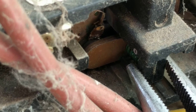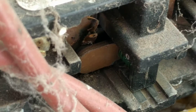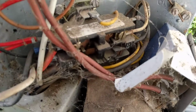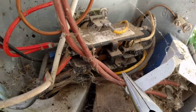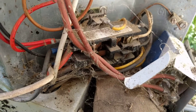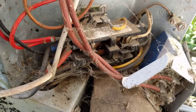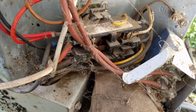This contactor may need to be replaced. I think we'll go ahead and replace this contactor. Sometimes it's as simple as getting the bug out of that spot right there. In this case, the contactor is actually bad. But sometimes you can just pull that bug out and snap it free, and you'll be good to go. So that's something to check.